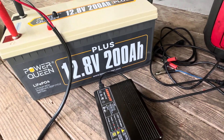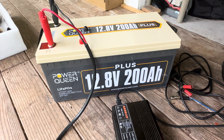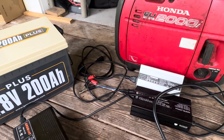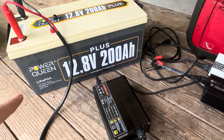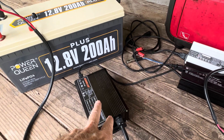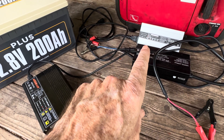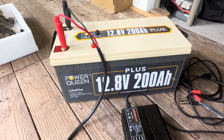Cameron was wondering if there were any special tools needed for this type of charging — no special tools needed. You'd obviously need your generator and some gasoline stored up, and that's about it. I've used all of these chargers and they all work well. The 30-amp will get you fully charged faster than 20 or 10. The 10-amp chargers are cheaper, and they go up in price with higher amperage. That's it for simply charging your battery.